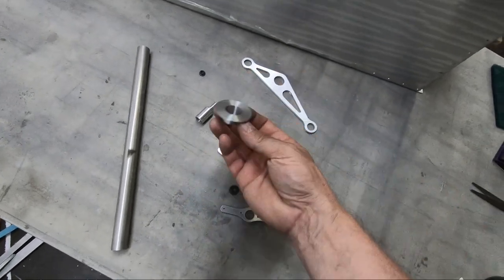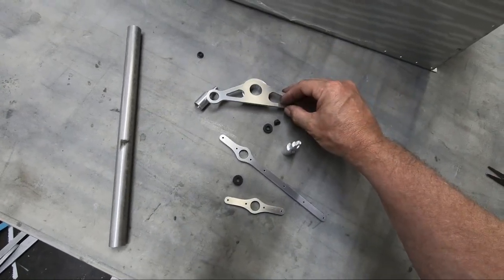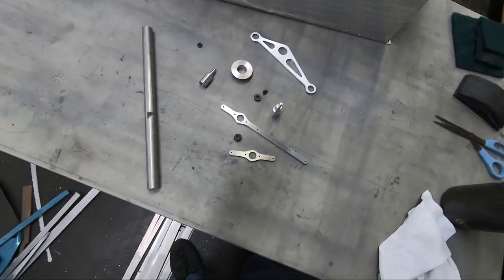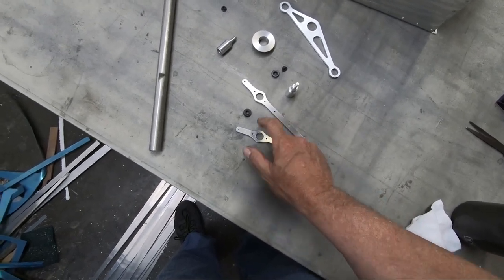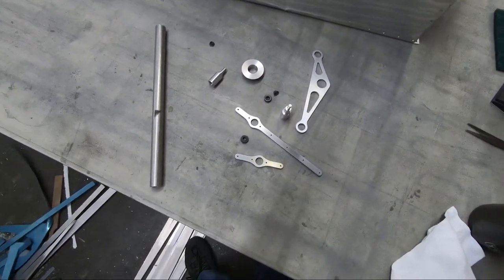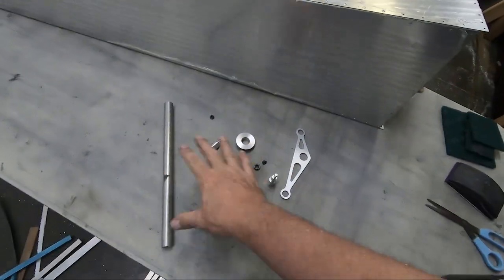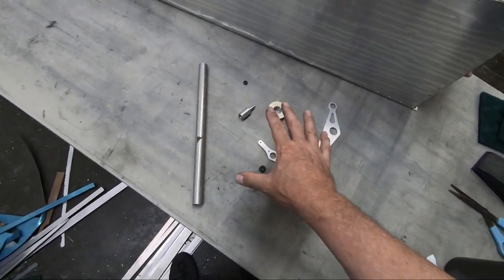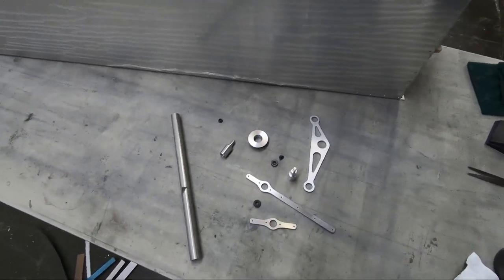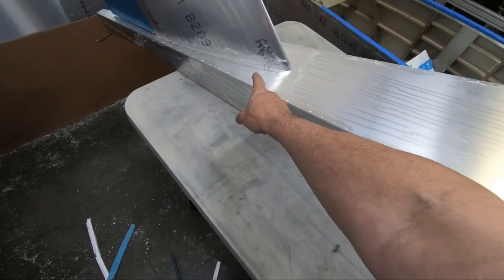I've got most of the parts here. This is the flange that gets rivets put into it that mounts on the tube here and then supports this assembly. I have some trimming and holes to drill to finish them up. I've got to alodine some of these parts, get bearings into here, and in either end of this assembly. I've got to mark and drill some holes and cut this tube to the right length, then start assembling this into the fuselage so I can get it all set up and installed and then start working on the actual flight control tubes.